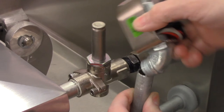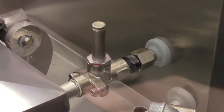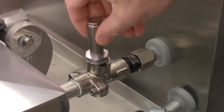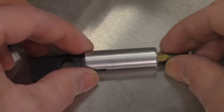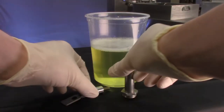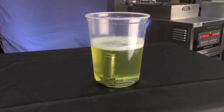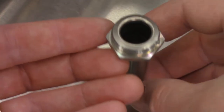On an 8-head fryer, this has flexible conduit, so there is no need to loosen the conduit. Use an adjustable wrench and unscrew the bonnet. Carefully remove the plunger assembly, paying close attention to the order of the spring, spring retainer, and the pieces of the plunger assembly. Soak all of these components in degreaser for a few minutes and then thoroughly clean each part to remove all oil residue. Remove the sticky oil residue from the inside of the bonnet as well.